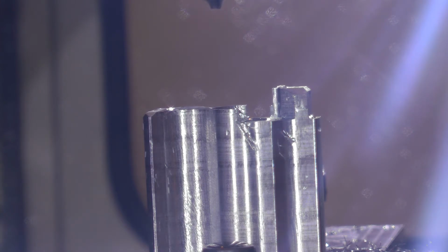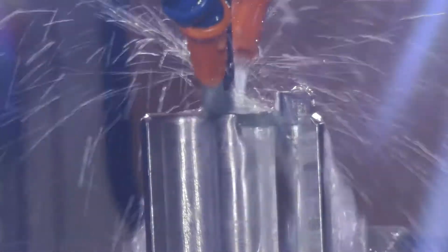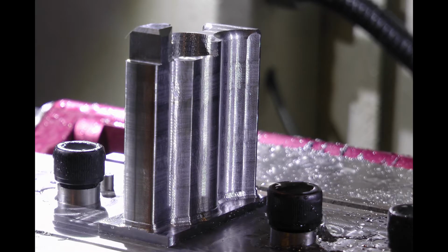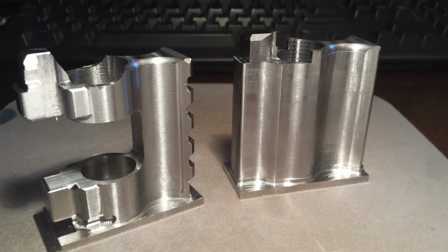And one thing I noticed was that this roundover, doing it in 1 pass, leaves a bit of a ledge, which you'll see in the photos later. A ledge on the side, and the reason being, I believe, is because those finishing passes that I took before with the long end mill that I did around the profile didn't quite go deep enough, and it's probably due to deflection. But it could be because I just misprogrammed the final depth pass because I was calculating how much needed to come off to get to the model. But I'll try to figure that out.